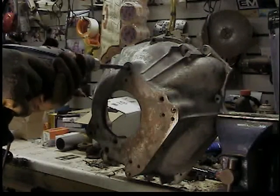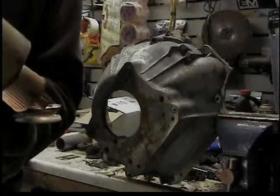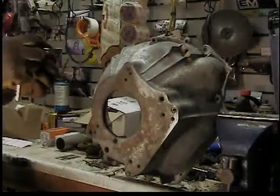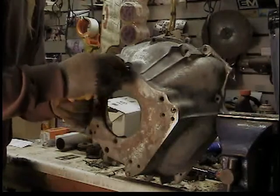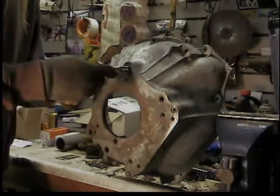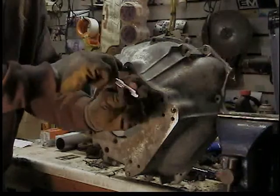This one's real bad, we've got to drill it out. When you buy these helicoil kits, they don't come with the drill bit, but the tap will tell you what size drill bit to use for that tap. Now this is a 7/16-14 hole tapped from the factory — that doesn't mean this tap is a 7/16 tap. This is a 7/16 helicoil tap, so it's oversized so that it will fit the inserts.